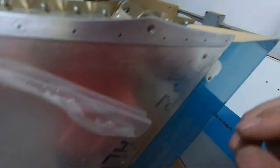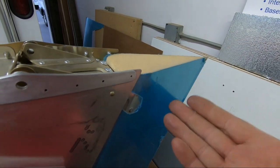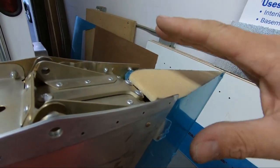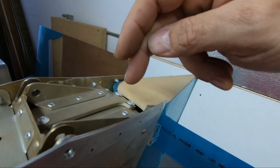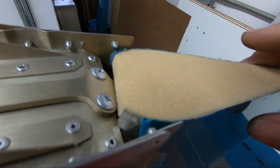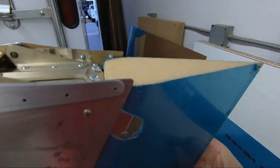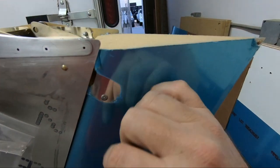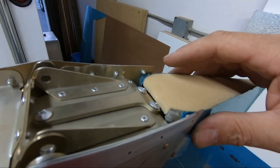I've checked every dimension and can't quite figure it out, because the rear spar is the right size — that should determine the height of the rudder. I've also checked the drawings on the rudder; the cutout is fine, it's the correct height. But for some reason it just feels like it's a couple millimeters too short from the fit between the rear spar of the vertical fin and the notch that's supposed to be here for the rudder — it just hits right on that 45-degree angle. The cutout is supposed to be lower because to get the pin out of the bottom you've got to raise the rudder before you can pull it out. I'm going to do some cutting to see if I can get this thing to fit and achieve about 20 degrees of movement right and left.